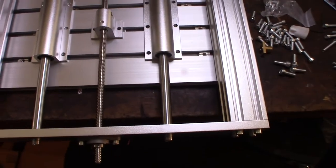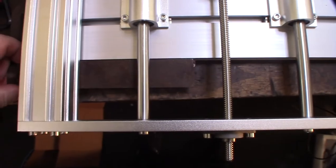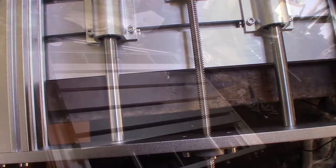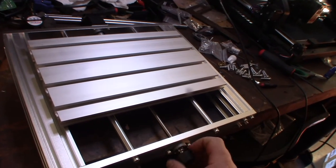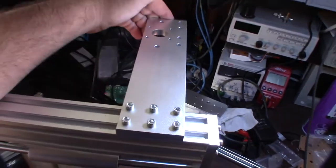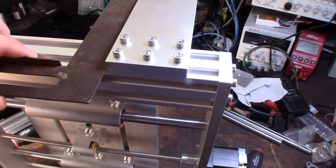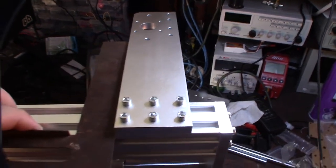Before you tighten down, use a square to make sure everything is even. I got the bottom Y-axis done - there's a cool little knob here you don't see on the cheaper 3018 Pro, which I think is really nice and helpful. Building the gantry now - this is why you want a tri-square to make sure it's 90 degrees before you lock it down, because if it's not exactly 90 degrees it could throw your whole project off. Onto day two - time to get the spindle and electronic control box on.